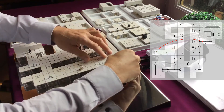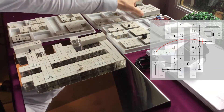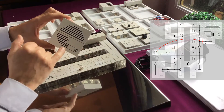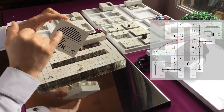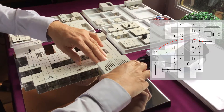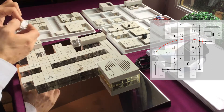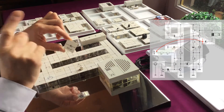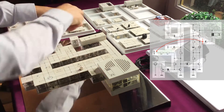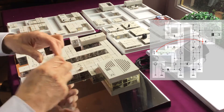This is the corner block. Finally, it's time to add a speaker. This is a T-block with a transformer connected this way — we place it here. To connect our speaker box to the amplifier, we need to use a capacitor of 100uF. Pay attention to the polarity. We put it here in our circuit. We then use a corner block to connect the capacitor to the speaker box.